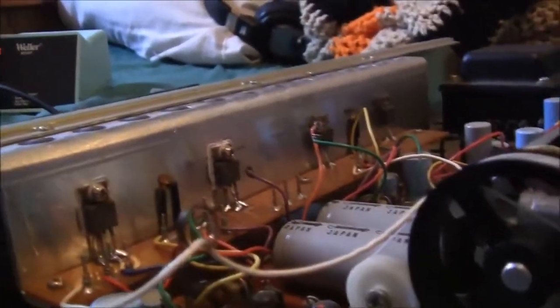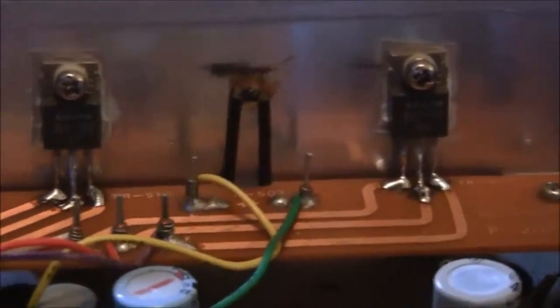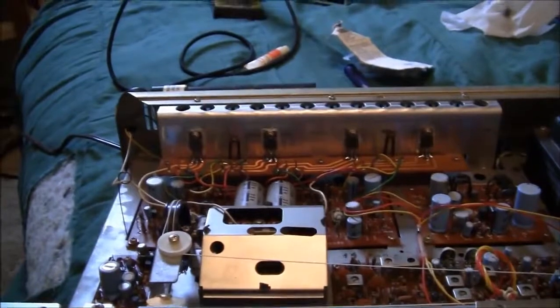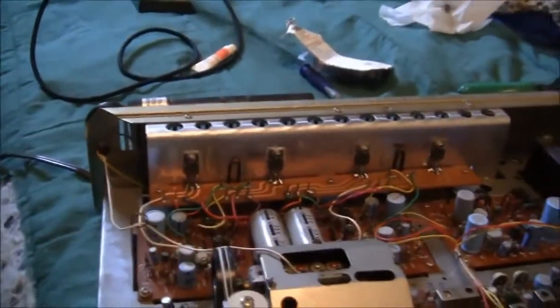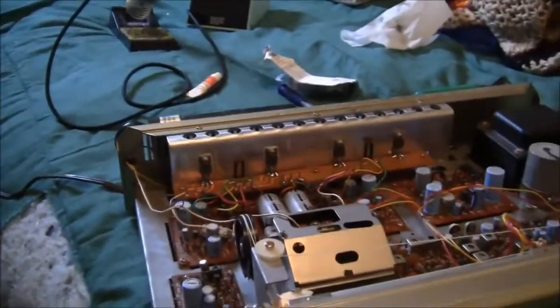I realized I put the new transistors on the wrong side, so I just swapped them over — now both sides have new transistors. You could say these two came from the other side, and the bad one is definitely wide open on all measurements. It's plugged in. There's no relay so it's all direct-coupled. Let's test some voltages and see if nothing's exploded — that's good. Usually if something's wrong it explodes immediately, not after a while.